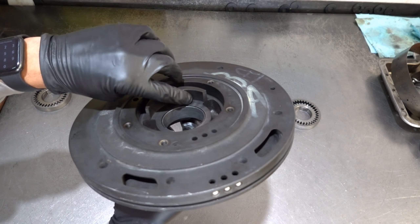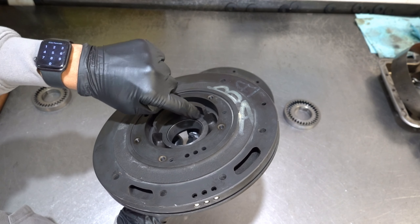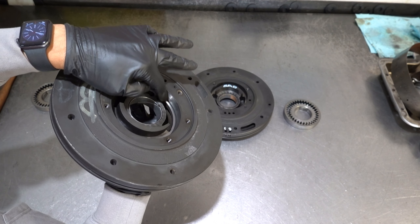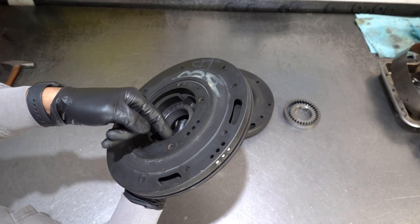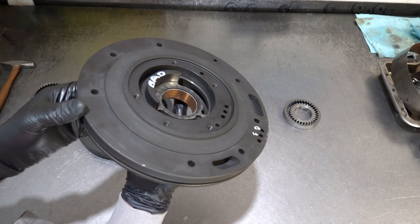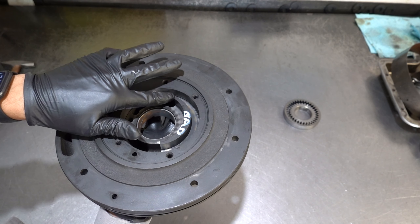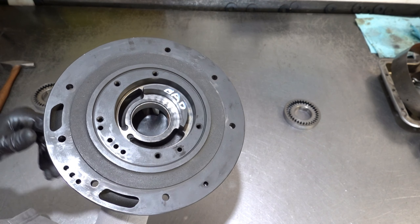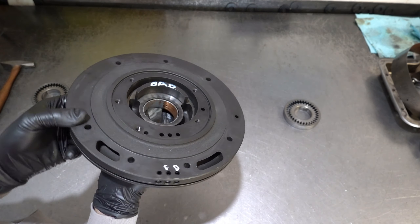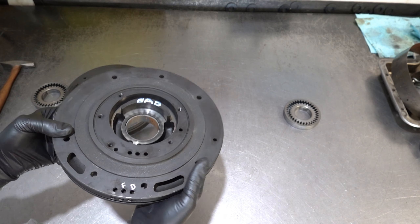Here's a good crescent — it's in good shape. It feels consistent from front to back and side to side; the working surface is good. You have some visual wear but not physical wear. Likewise on the side wall of the pocket, you have visual wear but no physical grooves or heavy scoring. On the damaged one the side walls actually look okay, but you do have scoring in one area that I can feel rather than just see, and there's wear here too. Either way, the problem is right here at the crescent — that's all the evidence you need that this needs to be replaced.